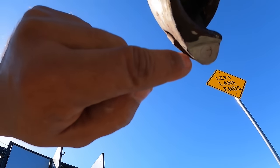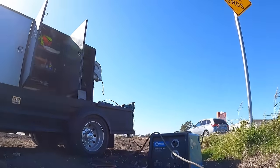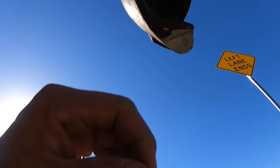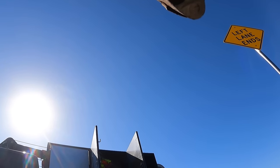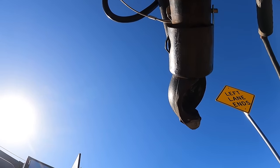Okay, so the thing is, that's such a small little spot. I'm gonna use a little welder here to try and just weld on that little pin so I can try and get a nut on it or something to pull it out. So we'll see. I keep that on here just for specific reasons like this. Even stuck bolts work really good. Okay.